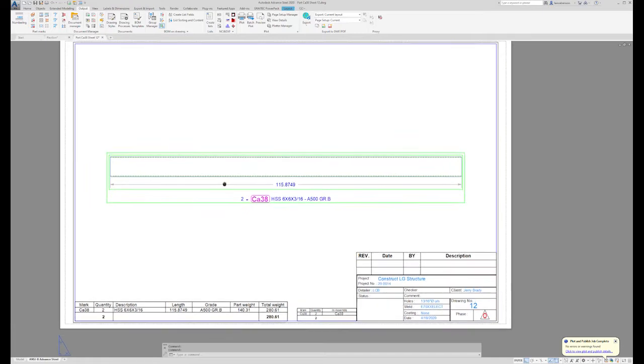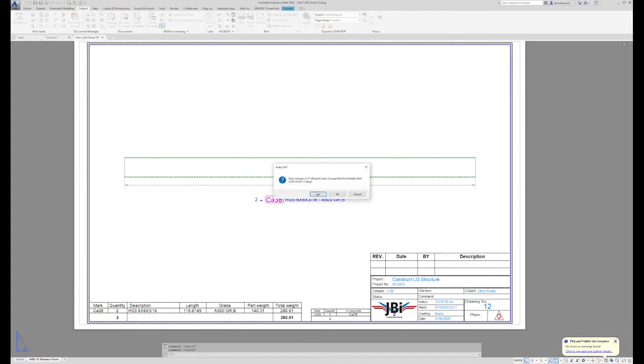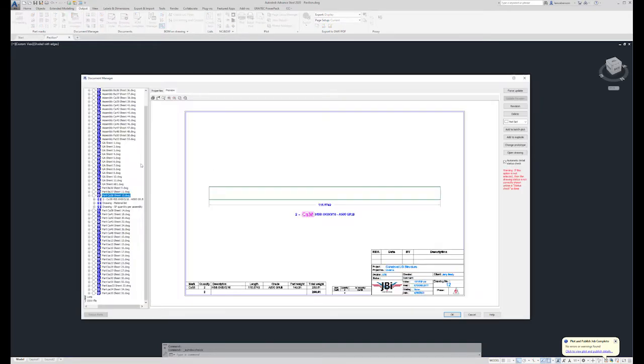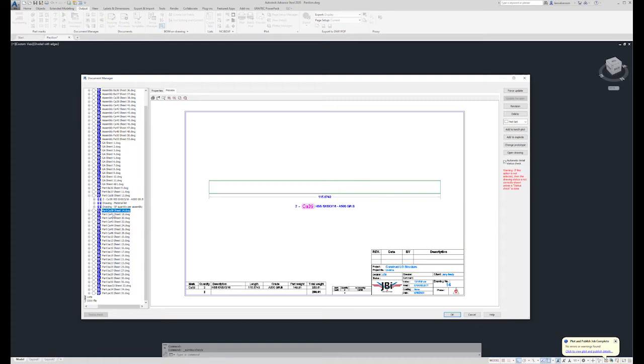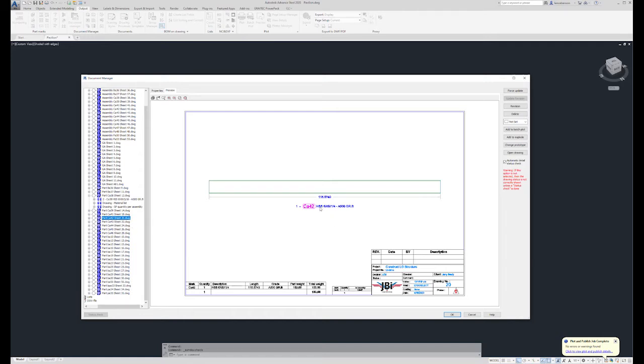Parts like this, I don't think I need to explain. I mean, it's a 90-degree cut on each end. It'll either be shuttled or cut in a manual saw. Pretty easy part. Same with CA39, CA41. These are all the HSS, hollow structural shape 6/6 quarter. They're columns, so pretty simple.